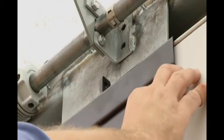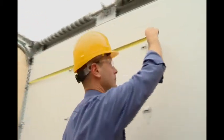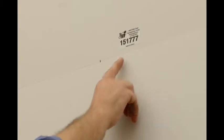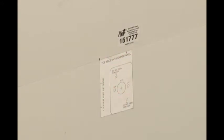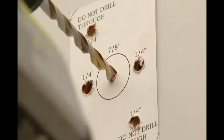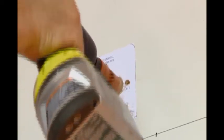Rest the mounting plate on the top of the door and slide it left or right until the connecting tab lines up with the new balancer bracket. Use the mounting plate as a template and drill five holes in the door panel. Measure the width of the roll-up door and mark the center line on the second panel from the top. Find the paper template in the Command Lift box, remove the paper backing, and stick it to the top of the second panel. Line up the top edge of the template with the top edge of the panel and the left edge with the center line. Drill quarter-inch holes as indicated on the template, and drill the center hole using a seven-eighth inch hole saw. It's recommended to drill a pilot hole first; for best results, drill halfway through the door from the inside.